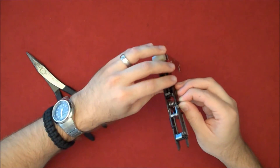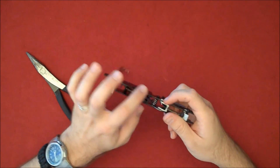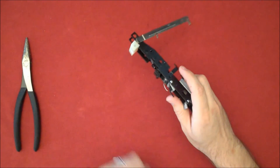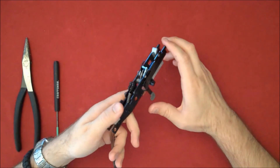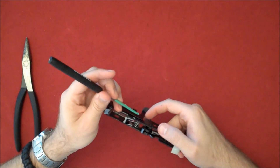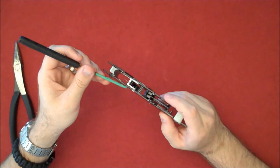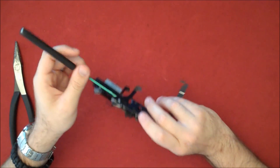Once you get it all in there you can let go of the detent. If it didn't go all the way back in, it's not seated correctly — that's not too bad, you can just move it around with your finger or a screwdriver. Once it's seated, you should be able to hold it in position up or down with the bolt catch release. You'll feel a little tension when it's moving, and you can look in between here and actually see the head of it. Next, this end is going to reside there, this end is going to come around and come out that window — we'll do that in part three.